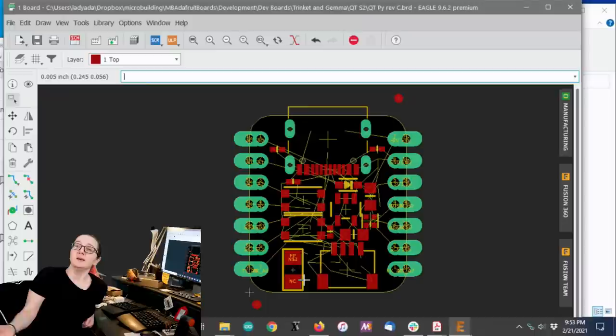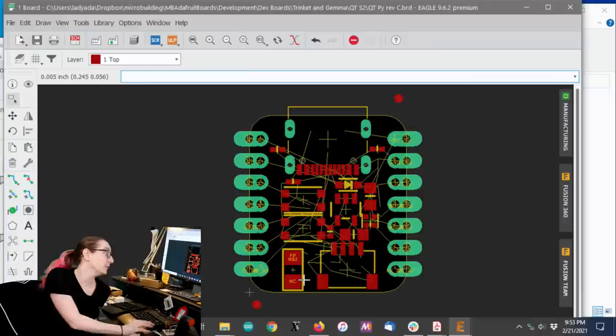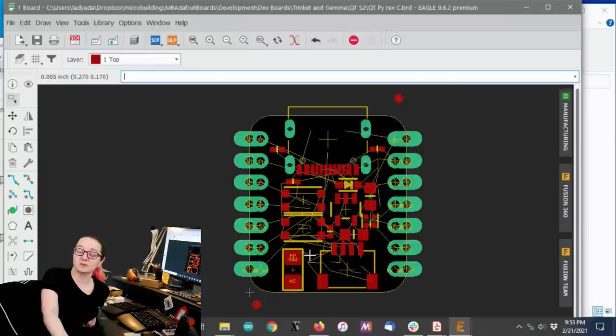So the antenna's on the top, and then I'll have maybe a wide via that goes through the PCB to the antenna trace on the other side where we have the matching capacitors and stuff. Although maybe I could have one output capacitor up here to match the antenna. Is it going to work? I usually don't do this. I usually put antennas on the same side, in one long straight trace, and I might still do it. I do have a little bit of space on the bottom for the antenna, but I thought it would be better to have the antenna radiating up off the top of the PCB than on the bottom, especially if it's against a breadboard or soldered into something.